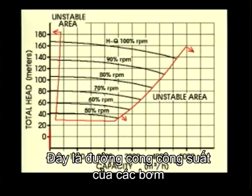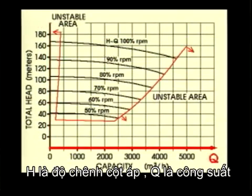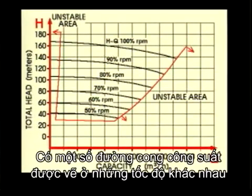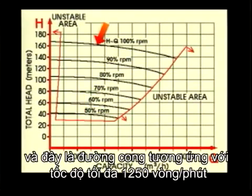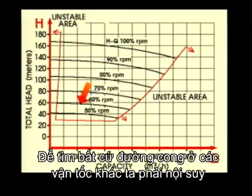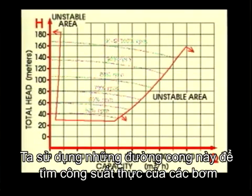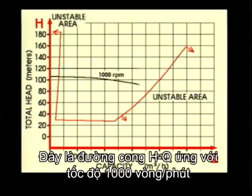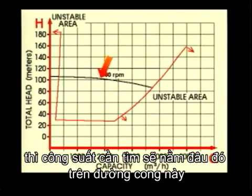This is the capacity curve of our pumps — the so-called HQ curve. H stands for head and Q for quantity. There are a few capacity curves drawn for different speeds. Here is the curve for 625 revolutions per minute, and here is for full speed, 1,250 revolutions. To find any other speed between these curves, you must interpolate. We use these curves to find the actual capacity of the pumps. This curve gives Q at the speed of 1,000 revolutions. If we run the pump at 1,000 revolutions, we must be somewhere on this curve.